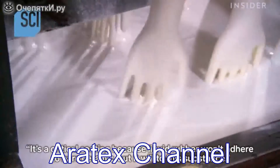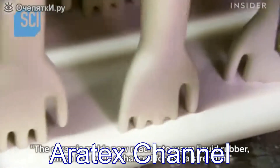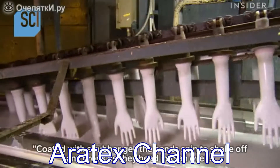The hand molds head into a chemical bath which forms a film on the surface. It's a critical coating because liquid rubber won't adhere to ceramic, but it will to this substance. The ceramic molds now reach into warm liquid rubber which has been enhanced for extra strength.